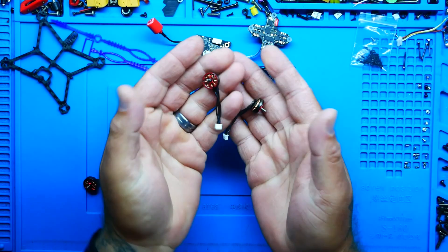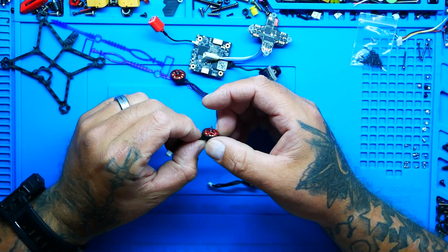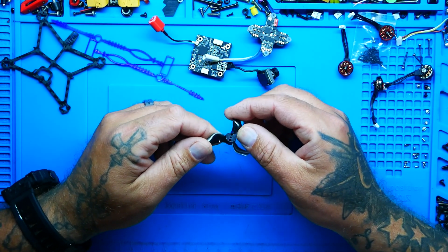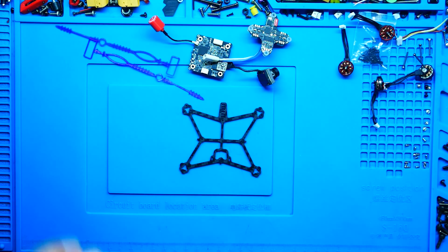For our stack I've got a magnificent stack here — this is a BetaFPV stack with ELRS built into it. You can see the antenna right there, and the thing weighs and feels like just about nothing. Last but not least, to make all the magic happen are our motors — look how tiny and cute these little guys are. They are beautiful red and black, also by BetaFPV — 1102 18000KV. My props are 40mm tri-blade 1635s.